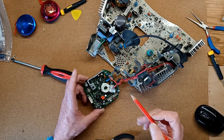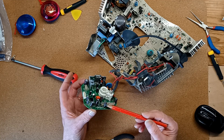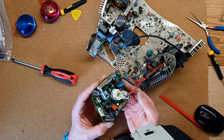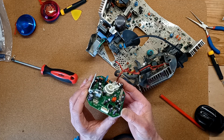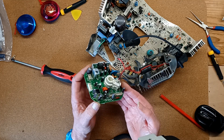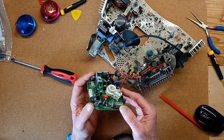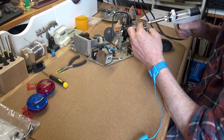So now we can see there are in fact one, two, three, four, five, six, seven, eight, nine, ten, eleven, twelve, thirteen, fourteen, fifteen electrolytic capacitors. On first inspection, none of them look like they're bulging particularly, none of them look like they're leaking especially, but I can almost guarantee all of them will be at the very least marginal, and some will be way out of spec at this age. Really the only thing to do is to remove them and replace them.